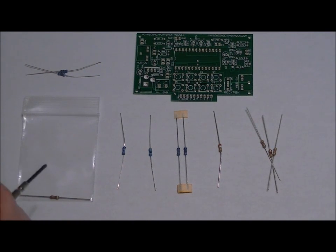So now let's have a quick look at the board. Once you have those segregated, follow me with soldering these resistors into place. We're going to have a quick close-up of the board showing you where all the resistors are placed. Now keep in mind, resistors are not polarized. They don't have a polarity. They can go in either way as long as they go in the right spots.